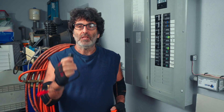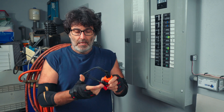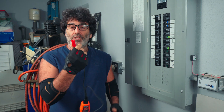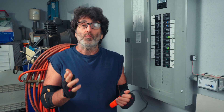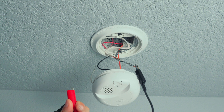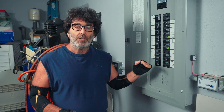One more test — the alligator clips on the junction box. This adapter comes with two little pigtails and doesn't need a ground adapter because it already has a ground. Just push them together. You've got two pigtails: black and red. The black goes to your hot and the red — which really should have been color-coded white — goes to your neutral. The whole point is we're looking for which breaker it is, so you'll have to connect these with the power live. If you're not comfortable working with live electricity, get an electrician. Clip black to black and red to white, being careful not to touch anything metal. You'll get another open ground indication — don't worry about it, it's still going to work. Then do the same learning phase and search for which breaker it is.